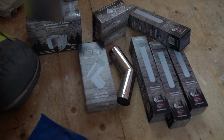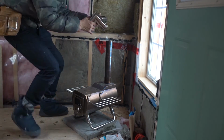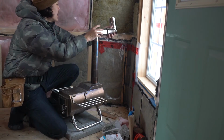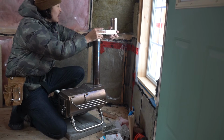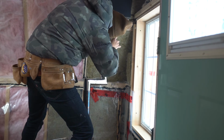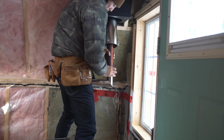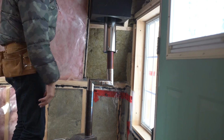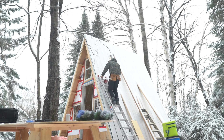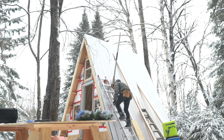So next up was really having that patio stone down, putting the stove on top of there. We connected one section of pipe, connected two 90 degree angles, so we got some separation away from the walls there, at least 18 inches or so. And then we were able to put the rest of the piping up through the chamber, with a secondary tent protector pipe there that essentially gave sort of a 1-inch separation between the original 2.5-inch pipe coming off the stove. And then of course we have extra sets of piping that go up through the roof. So it comes pretty close to having a 10-foot separation there on the horizontal from the flue of the pipe itself to any sections of the roof itself as well.